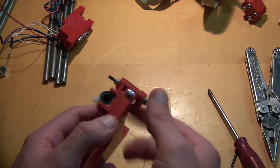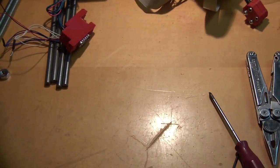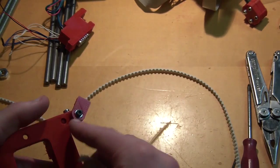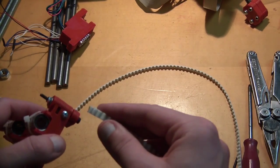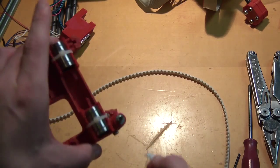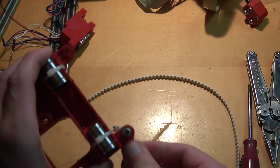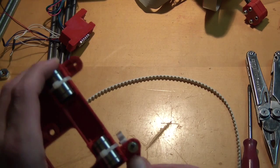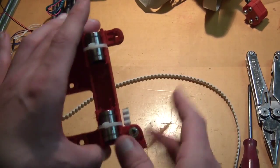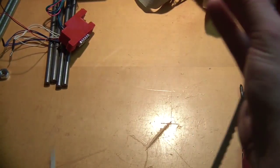We're not going to completely assemble the belt right now. It's just to hold everything in place. So now you're going to take your belt. It goes through this little slit with the tooth to the lower side. Hold it with the linear bearings up and then tooth up — you get it through there. It might be a little bit tricky, but once you get it through a little bit it's pretty easy to pull it all the way. So just put it in like this and leave it like this.